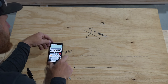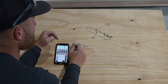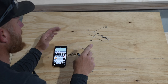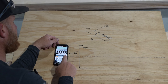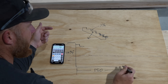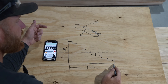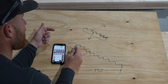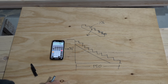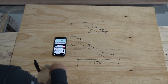We've got 16 steps, but the last step is the top landing itself, so we subtract one — giving us 15 actual treads on the stringer. Doing 15 times 10 inches gives us 150 inches of total run. So my staircase will come out 150 inches and rise up 7 and 7/16 inches shy of the full landing height. With that information we can now cut a stringer.